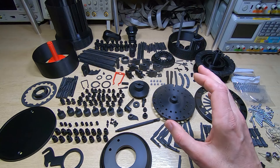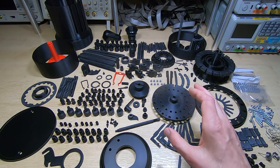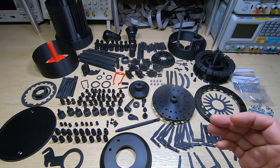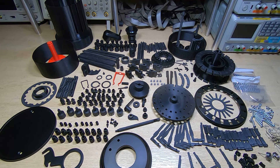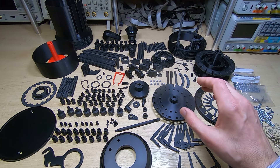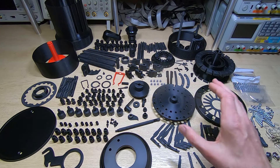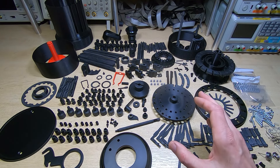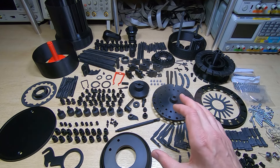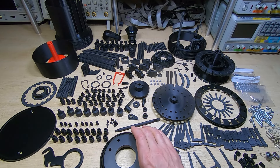One thing that's really important — something I mentioned in the repair videos — is that the key to getting a 3D printed calculator or any complex mechanism to work reliably is to reduce friction. Friction is the killer to a project like this. Everything must move freely, must spin freely. There's no point proceeding to the next step until all the parts move the way they're supposed to.